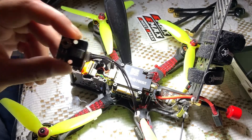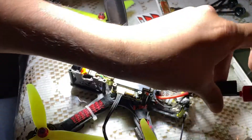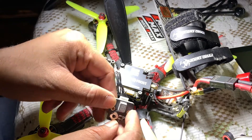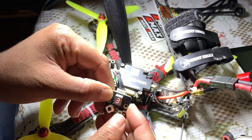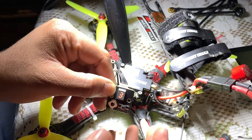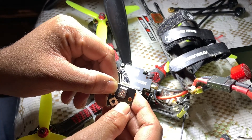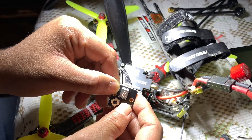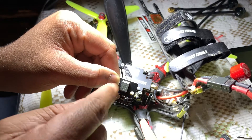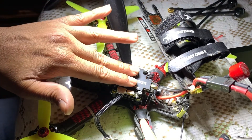You will also get this board - please make sure you do not lose this board at all. You connect this board, power and all that, and plug it on with props off. You will see this board out here and you can click it - this is your channel. You can keep clicking and change your channel. There are four high quality channels; I'm in channel number three. Hold to save. When you see the dot appearing, that's your milliwatt setting: 25 milliwatt, 200, and 450. Hold the button to save - when you see the H sign, you are set. This will turn super hot, so do not plug it in for a long time.